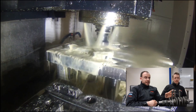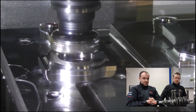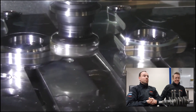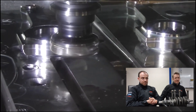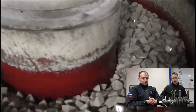Which then obviously get sent through to the machines - the CNCs - which then do obviously the milling operations. Specialist mill on the little ends and big ends. It's all fully automated, there's no guy standing there doing it - it's all programmed in. You'll see it milling the ends there. Then that's crack testing, and then that's being rumbled to give it a nice quality finish.